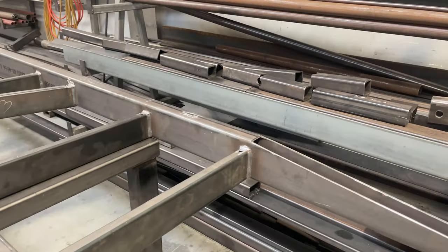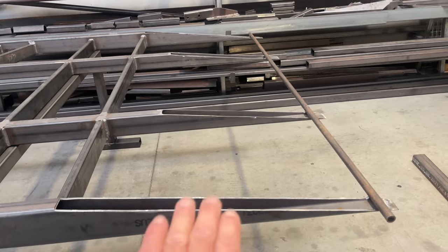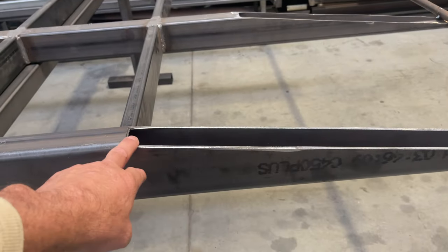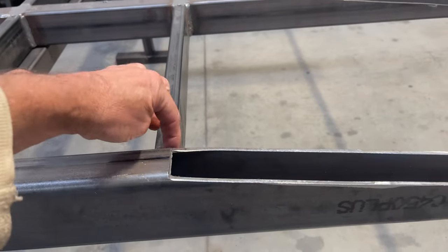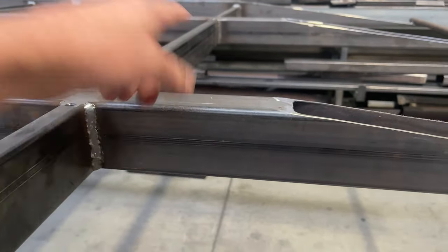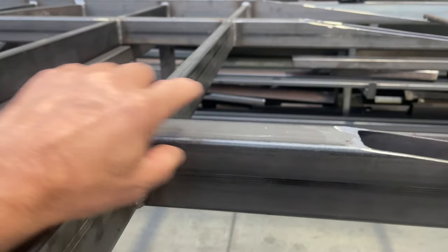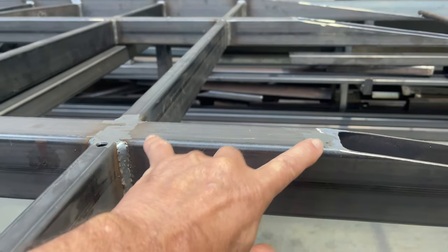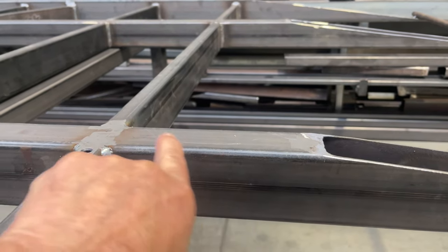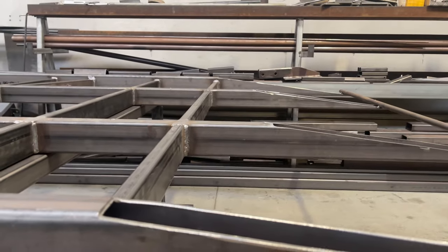The floor goes right across the chassis until it gets to the other side. Something you need to think about is when you cut your bevels at the back for your tread plate, there'll be two heights to consider. On the 100 by 50, the wood or deck finishes at the top of that member. On the lower 75mm material, the deck is going to be sitting 17mm higher and will stop in there. So the tread plate will be unsupported in that area and you'll need to weld in some material to take up that space.